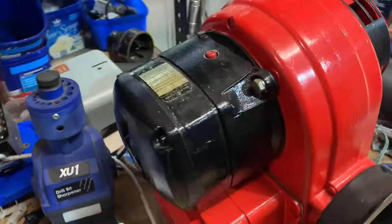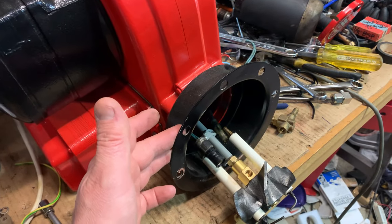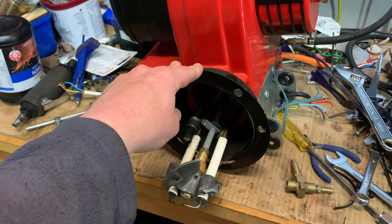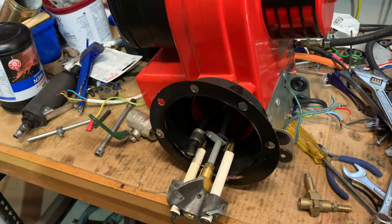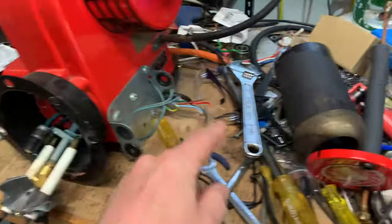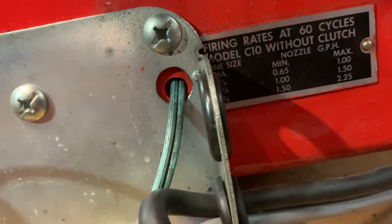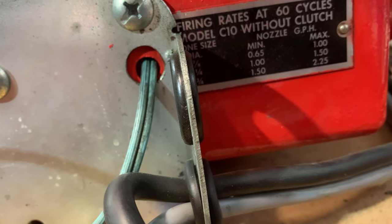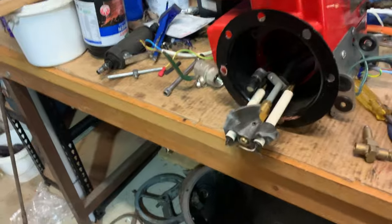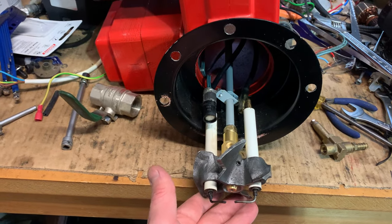It's a nice little burner, this one — very compact, so it'll fit into a small space. It doesn't protrude back much. The fact it's got a flange mount is awesome; that means you can mount it on your door and you don't need to sit it on a pedestal. It's got a nice short little combustion tube on there. There are a few more details in there for different firing rates with specific nozzle diameters, but we'll be ignoring that because with waste oil it's all controlled by your air pressure and the size of the orifice and jet.